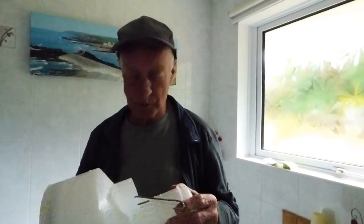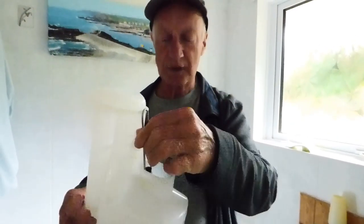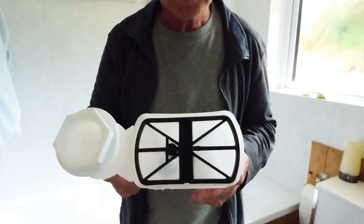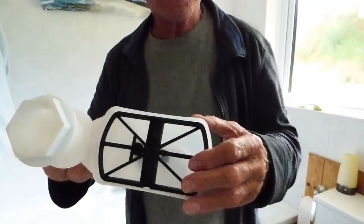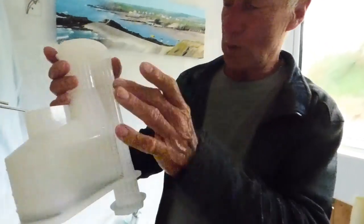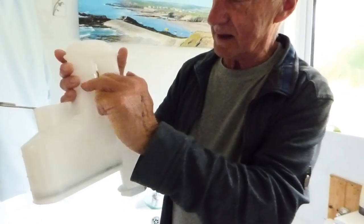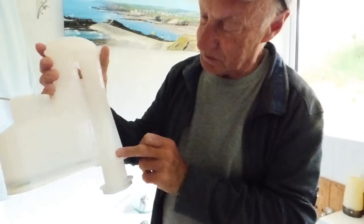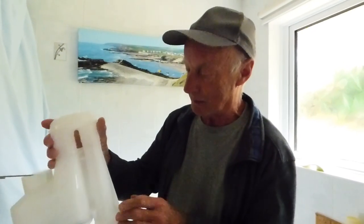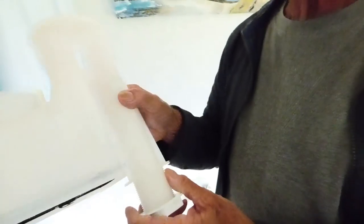The last type of siphon is this one - rather old-fashioned now. These are in the older type of toilets with a handle attached, and you flush it like so. When you do this it goes up and down inside - this part is the moving part of it. Quite often the washer splits and that's when they won't flush very well, and usually that's the reason - very cheap to fix, but awkward if you've got to take it right out of a close-coupled cistern from the pan. What can go wrong with these is that water runs into the pan. Quite simply, when it's sitting in the cistern, this part is in the water up to the water line. If there's a crack or split in here, it will start to trickle water down the inside into the pan. It usually happens on the seam - that's the weakness - and if you get a little split there, it will start to run. That's the only thing that generally goes wrong with these.